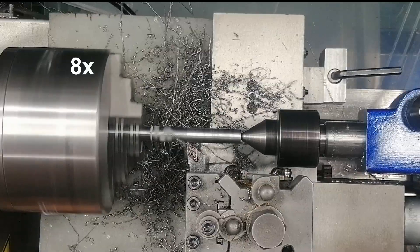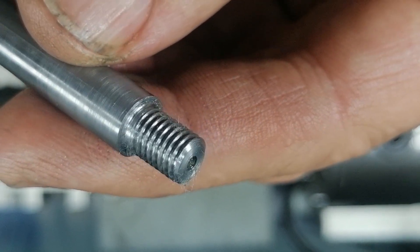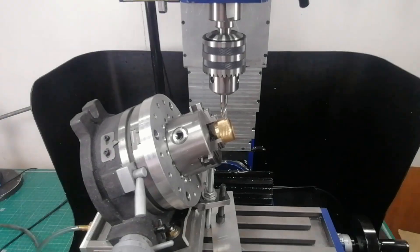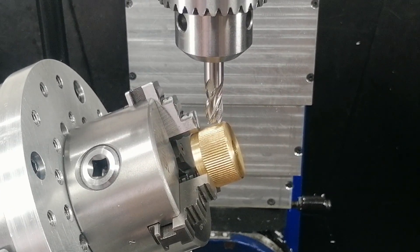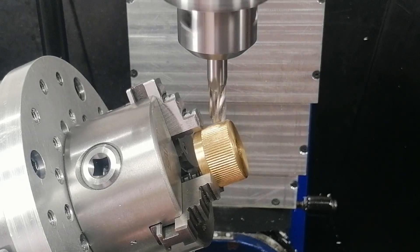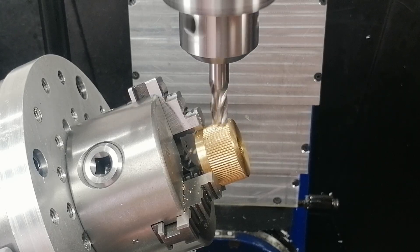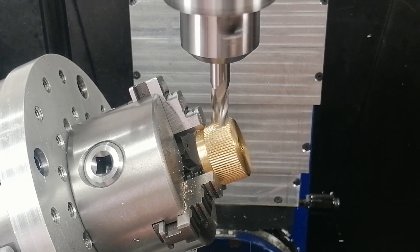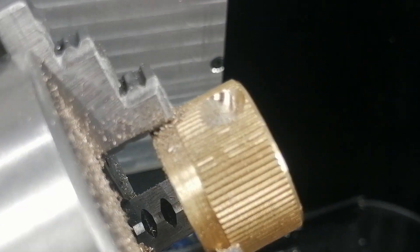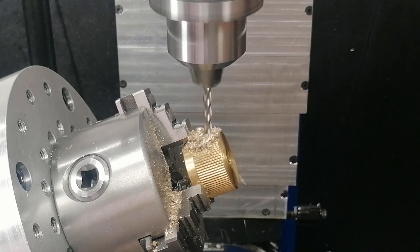I built four spokes from mild steel and cut single threads on the end. Then I removed the brass thumb wheel and mounted it on the rotary table, tilted about 20 degrees. The angle matches the slope of the downfeed wheel spokes, so once these are installed, they'll sit naturally under my fingers — comfortable to grip and consistent with the rest of the mill's design. I milled a small flat on the first spot to help the drill start through and where the spoke can be seated, then spot drilled, drilled, and tapped the first hole.